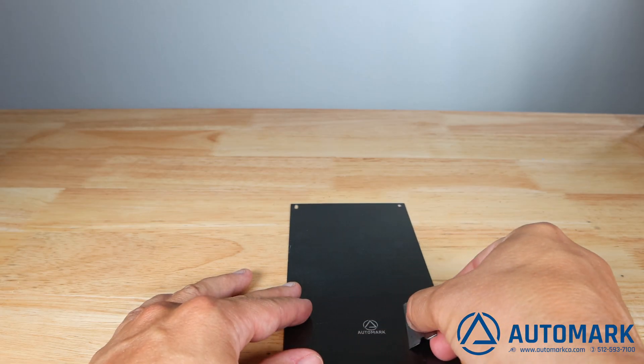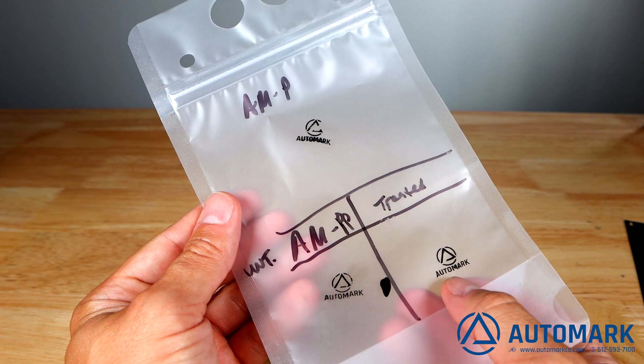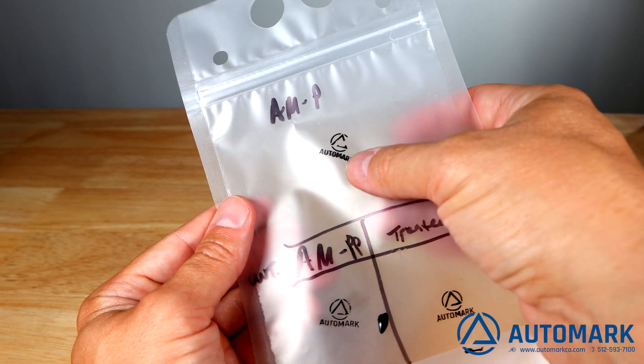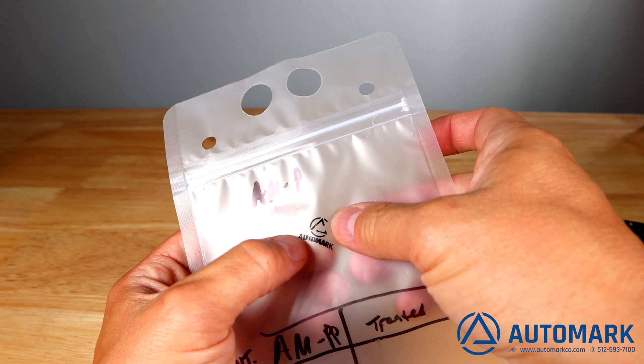Simply wipe on the primer. After we mix the ink, we use the razor blade and pad to manually mark the images under the part to test for adhesion. Remember, we are only wanting to see which ink sticks for the purpose of this test.